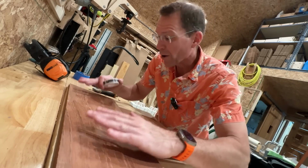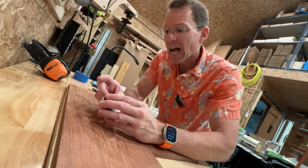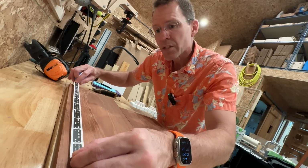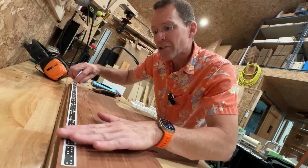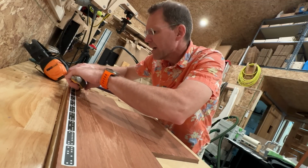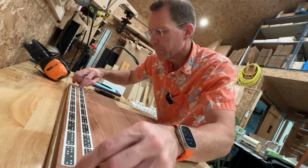All right, now that we've got our secure little work area, it's time to use the dominoes. Dominoes are what these little stickers are called. It's what the electronic eye on the Shaper is looking for, and it's how the Shaper knows where it is on the board that you are cutting. So I'm going to stick these fellows down carefully. You don't want to stretch them while you stick them on. There's a whole discussion on the best way to use dominoes. I don't want to waste them, so I'm going to carefully cut them and stick on a good number of runs.